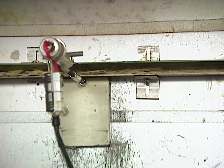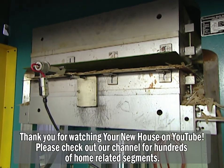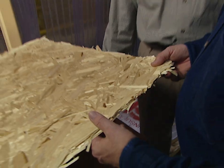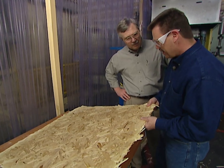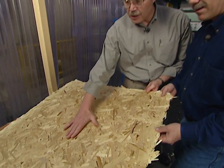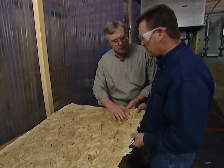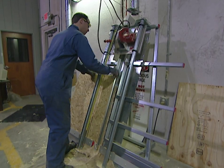The wafers are pressed at 450 pounds per square inch and temperatures up to 420 degrees for two minutes. The computer keeps track of everything, including the amount of moisture in the board. It's incredible — we took this big pile of wood wafers and compressed it into this solid board. It comes off the press with excellent adhesion and a very smooth surface. The edges are rough but get trimmed automatically in manufacturing, and that excess trim gets recycled back into the process so nothing is wasted.